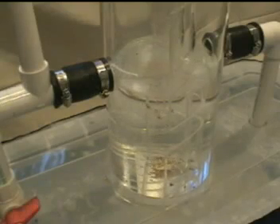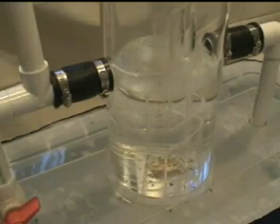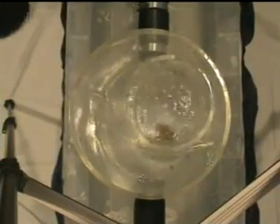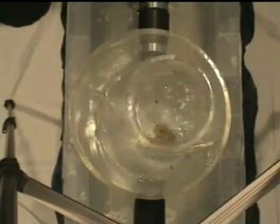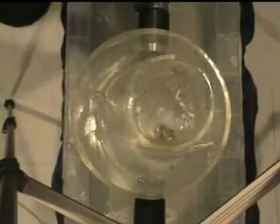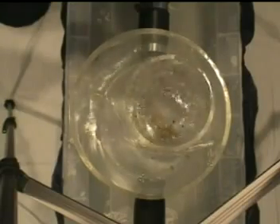The clear scaled model clearly shows the vortex motion of the particles inside the inner chamber. Particles spiral downwards toward the center of the separator's sump. In addition to creating a centripetal force on the particles toward the center of the separator, the vortex motion maximizes the flow path of the particles, providing them with the maximum amount of time for settling. The vortex motion also ensures that the water flows in one direction through the separator, which minimizes any currents that could negatively affect the settling of solids.